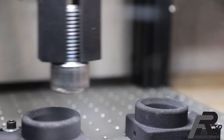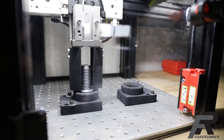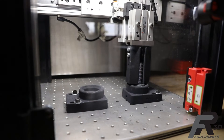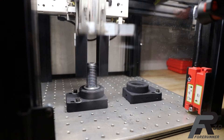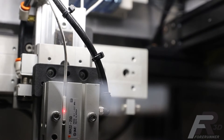The test we came up with was simple: grab onto a metal part with the most aggressive surface finish possible and move it back and forth between two nests for one million cycles, then measure the wear. The part we ended up going with was a one-inch steel socket-head cap screw. We felt that grabbing onto the sharp edges of its threads would be a reasonable approximation for the worst-case scenario gripper fingers like these would see in the real world.